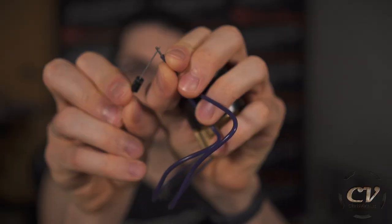This is a solenoid valve right here, and there is a coil inside. You hook this up to a power source of 12 volts and this valve will open. But once you remove the power source, the coil still has a magnetic field that needs to go somewhere — it needs to dissipate. Right at the moment when you remove the power source, a spark gets created, and sparks are dangerous. This back EMF, this voltage spike, can fry a relay or other small components not made for handling a voltage spike.